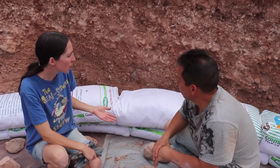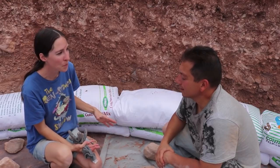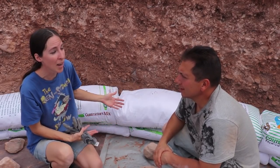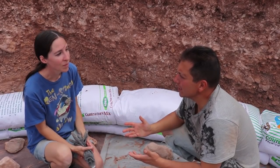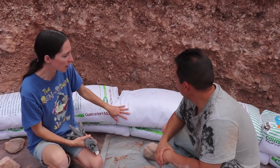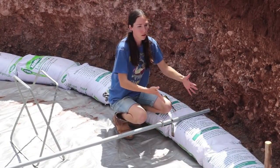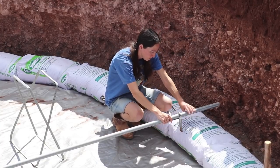But it's really tricky because the problem is they're different width after you tamp them. And we didn't really know what that difference is with these bags. Now we know, now that we've done a whole course. We were seeing like a 3-inch shift. We'll have to place the bags 1.5 inches further than what our bracket is set at for the tamped width. Did you get that?